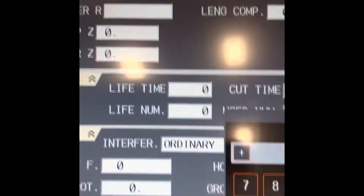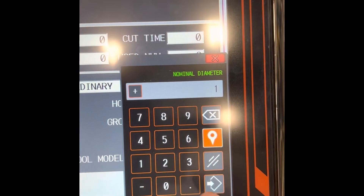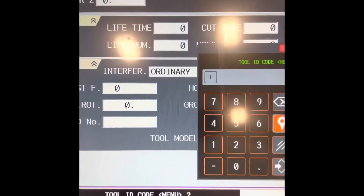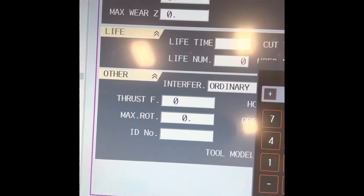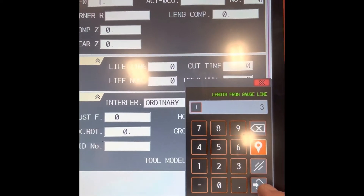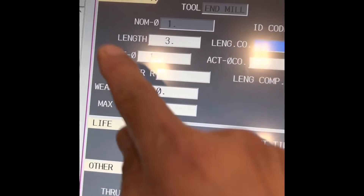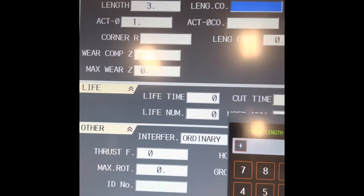Nominal diameter — we are going to input 1 inch. Enter. Now 1 inch. We are going to ask for the ID code on this machine. Here it is F — F for finishing. Then put some value on this machine. I usually put 3 inches. Hit enter. That is 3 inches length, because the machine won't work without the value. Just put at least 3 inches.